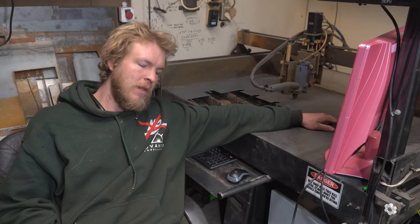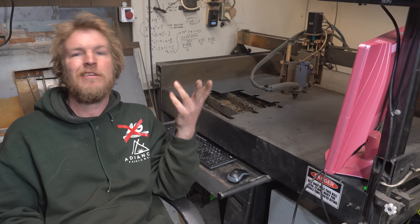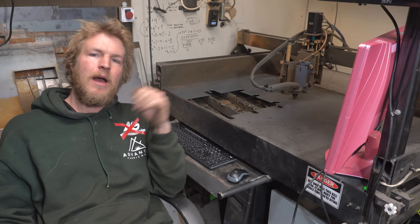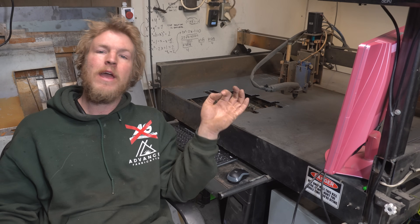This thing's definitely going to come in handy. I may end up mounting it somewhere and calling it my shop computer. I partitioned the drive to run LinuxCNC and Windows, so I could try to run Mach if I want to. I'm not too familiar with Mach and I really like LinuxCNC. I'm probably going to mess around with the power-saving options to get that base period jitter down, because the hardware on this machine is way overkill and I want to harness that. Over on Patreon I'm going to make one of my first modules — a little Wiimote nunchuck jog pendant like I had on the laser. If you'd like to see that, go support me on Patreon. That's what I've got for you this week — thanks for sticking around, and remember to leave a like. Thank you for watching.